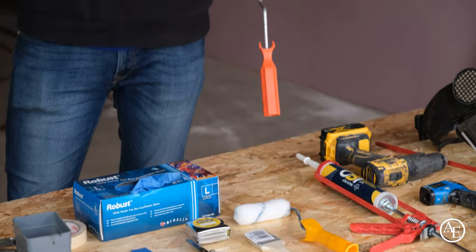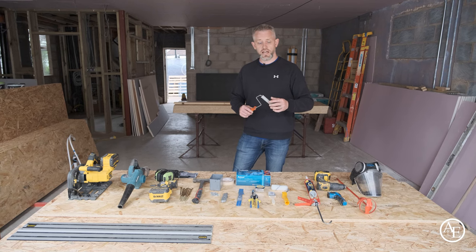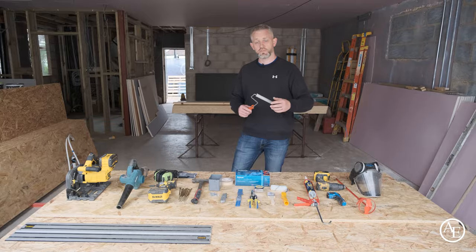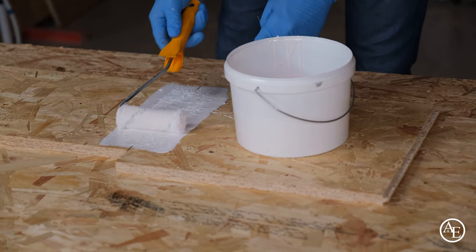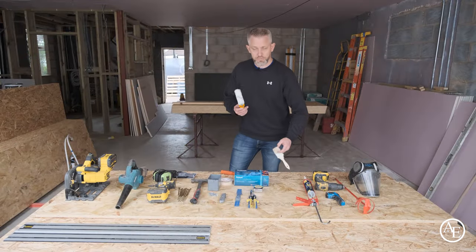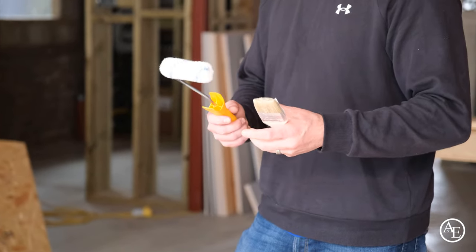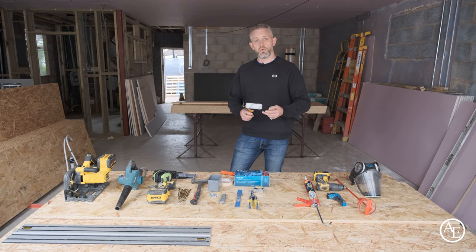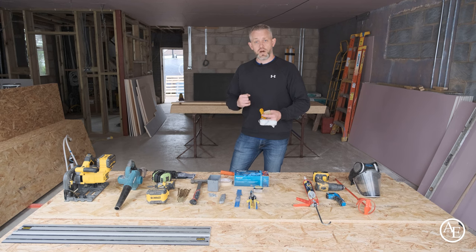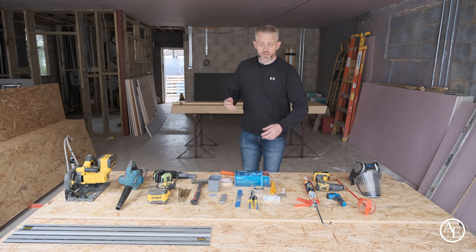On the 2020 system we don't use consolidating rollers because the viscosity of the resin and the matting is 225 grams, so we don't need bubble busters — we use fluffy rollers throughout the system. On small details you'll use a four-inch roller with paintbrushes to get into the details, and when laying the main deck you'll use a nine or ten-inch roller, probably on a pole for longer reach.